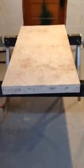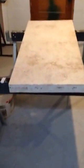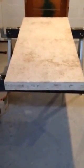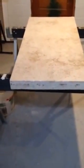Well, I made some progress on the second tabletop, which used the white Portland with just the one layer of GFRC, not a face coat and a back coat, just the one coat. If you remember from a previous video, I made that a little thick to create some voids in the surfaces, which for a lot of things you don't want, those little air pockets in concrete, but for this project I kind of wanted that to fill with unsanded grouts. So I've already done the grouting, but I want to catch you up on what I've done.